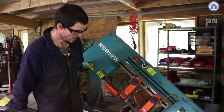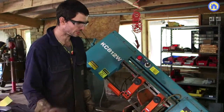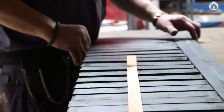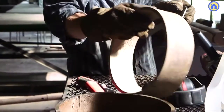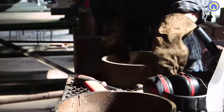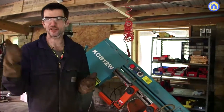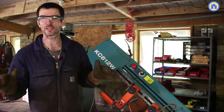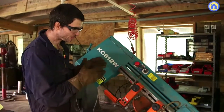Metal typically has sharp corners, and that's about it for the bandsaw. It's a very important tool — a lot of prep work happens with the bandsaw. Cutting pieces like these here, we can do that on a bandsaw or use the iron worker for that. But if you've got especially very thick, like solid shaft, say three inches, that's where you definitely want to use a bandsaw. Otherwise, an abrasive cutoff saw would take way too long. The iron worker can't handle it because it can only do flat things. The torch will get you a very messy cut. So when you want a nice, beautiful cut, that's the tool to go to.